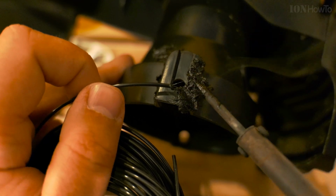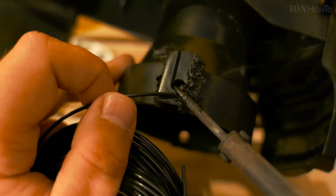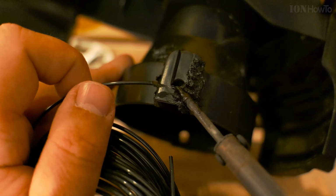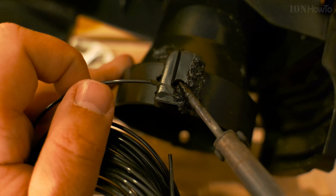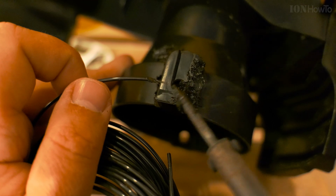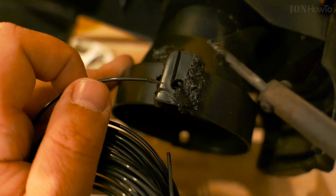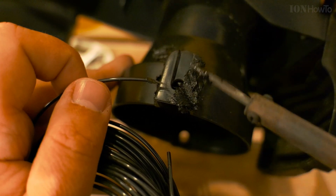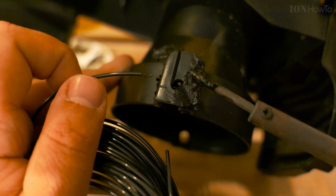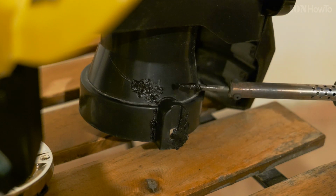If you want the ideal, I will put links in the description with the plastic welding machine and the staples. There is the machine that is actually really a soldering iron, but the type with a transformer in it. And usually they have a piece of wire connecting both sides, which gets hot. But in this case, the staple for the plastic welding machine is the thing that gets hot, makes the connection between the transformer elements, and it becomes really hot. And yeah, check the links in the description if you want to see that. Otherwise, soldering iron, if you have one, use that, it's fine.